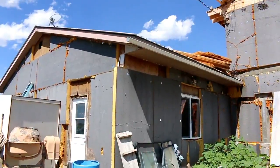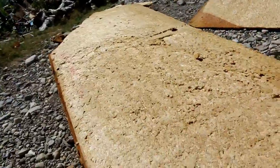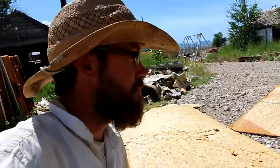This is not quite as good insulation as the polyisocyanurate, or polyiso, that's currently on the house. I was very, very fortunate indeed to find such a good deal on that stuff. You can see what that looks like right here. But it is R7 per inch, whereas this stuff here seems like it's more like the kind that you'd get in a spray can, or a spray foam, Great Stuff or whatever. So this is probably closer to R5 per inch, which is still pretty good.